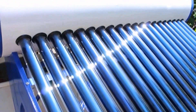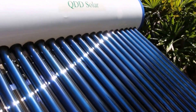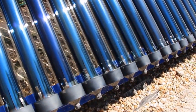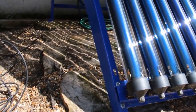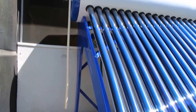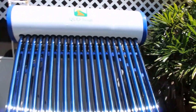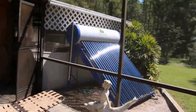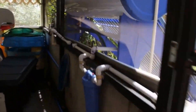Behind that is my hot in with a check valve again. You can see the PVC pipe — these are the evacuated tubes. These tubes are comprised of two pieces of glass; between them there's a vacuum which acts as a perfect thermal insulator, and all the way inside is a metal rod comprised of copper that injects the heat straight up into the water heater.